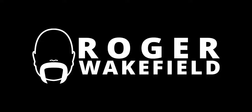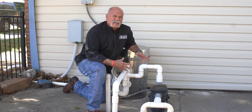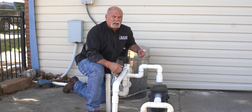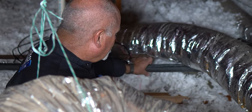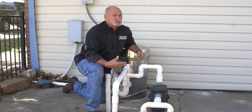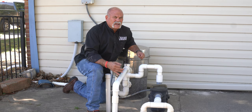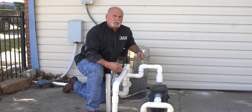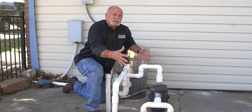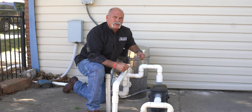Five ways to prepare your pipes for winter. If you're protecting your pipes wrong, you're going to have a problem. We're talking outdoor piping, hose bibs - frost proofs that stick out of the wall and hose bibs that stick up out of the ground - and exposed piping up in an attic. If you've got certain pipes you can't protect, leave a faucet dripping, leave cabinet doors open, try to heat up that room, or set a fan to blow air under the cabinet.